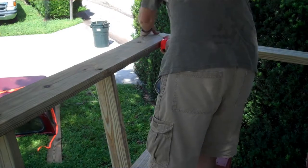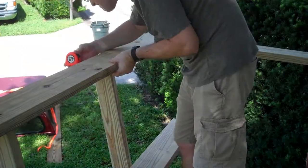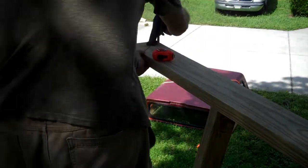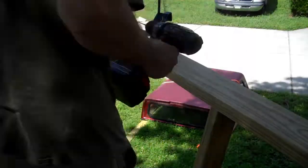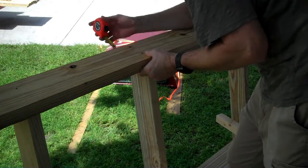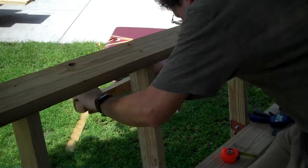The instructions indicate a 3¼ inch overhang on the back so that the 1½ inch 2x4 on the bench back lines up correctly. I used a clamp to hold the two boards together and screwed the corner before attaching either board to the uprights. You might have to carefully adjust a few of the uprights before screwing them in to maintain the 3¼ inch overhang on the back.